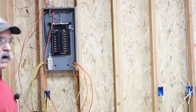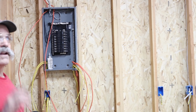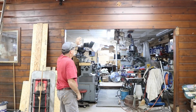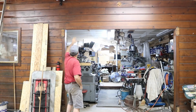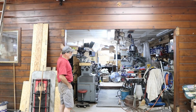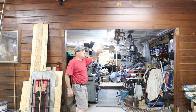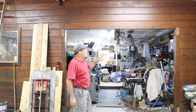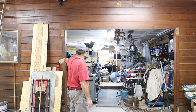Now I still don't have all my boxes in. I have my outside boxes to install, wires to run for that, and a couple more lights and things like that. Now this is the old exterior wall. The doors are gone, and what I'm going to do is fur this wall out 1.5 inches, put some new trim around the doorway, and then it will have a covering of 1/2 inch Doug fir, sanded one side plywood, all the walls, and I'll go over that. And this is going to allow me to run wires down the walls.